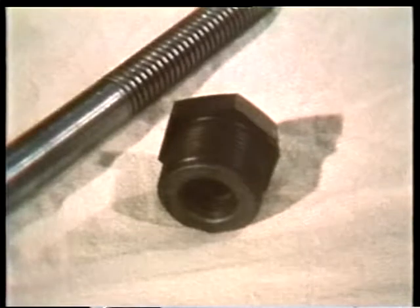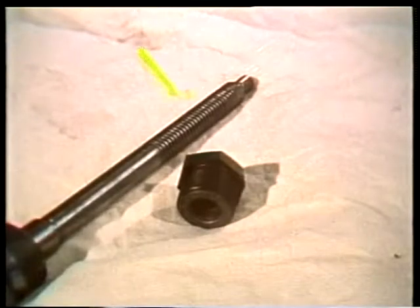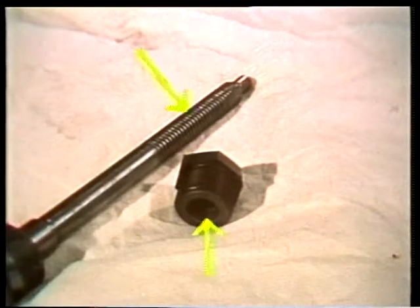Another part of the valve that should be inspected is the stem bushing. The threads of the stem rotate on the threads of the bushing to open and close the valve. For this reason, the stem bushing receives a lot of wear as the valve is operated. And when the bushing threads wear out on a rising stem valve, you can't close it anymore. System pressure will force it open.